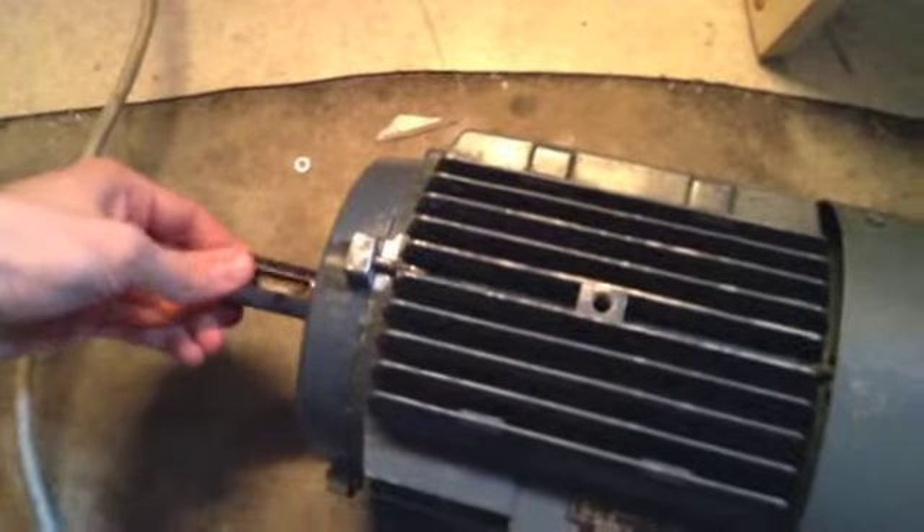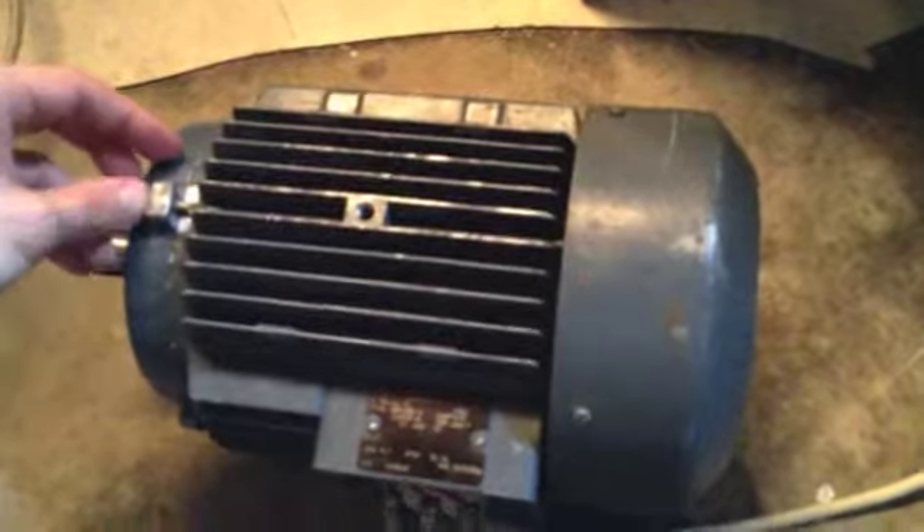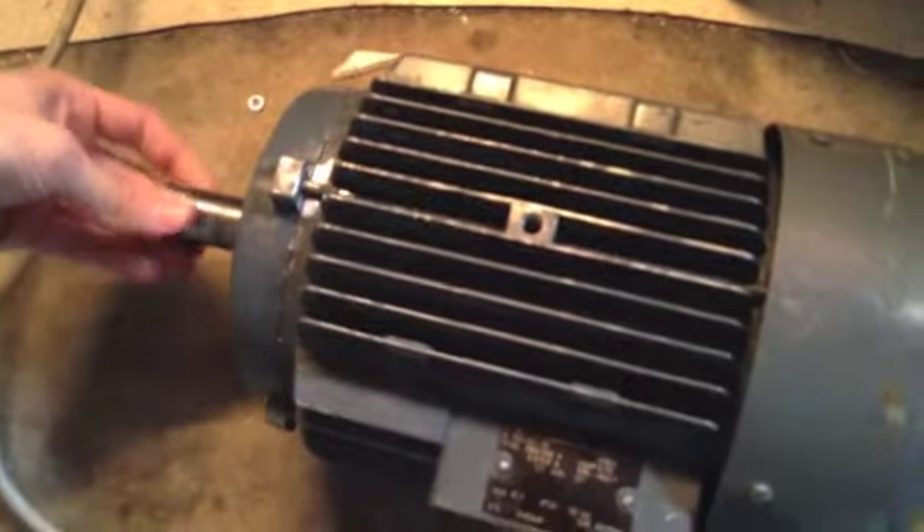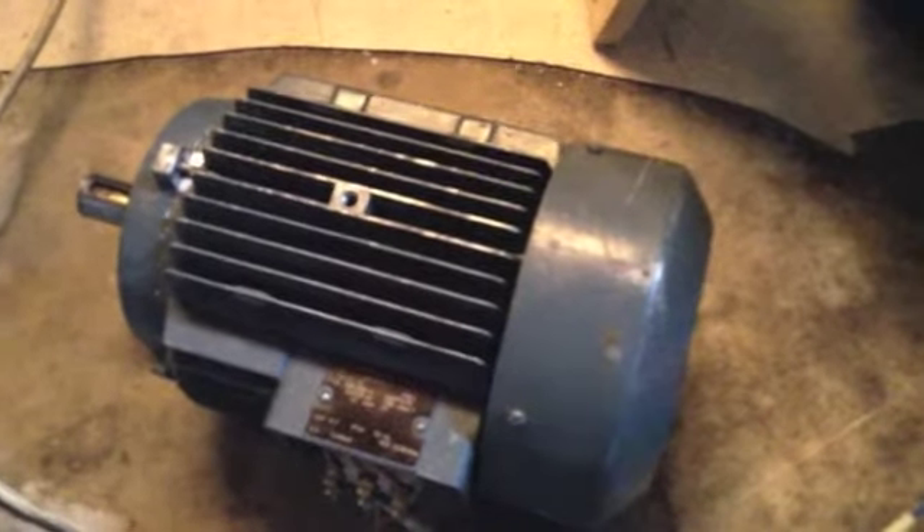So this was not really a successful tutorial, but my advice for rebuilding such an electric motor: if you don't have the right tools for it, I spent days trying to hammer those bearings on the shaft, and if you do that for too long, it will ruin the bearings. So if you don't have the right tools, search for someone who has them. Don't try to improvise too much, because then you risk the bearings and you'll have to buy new ones again.